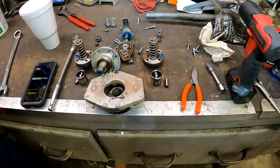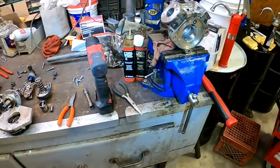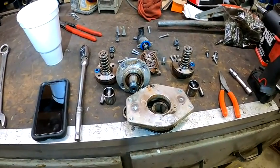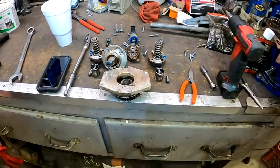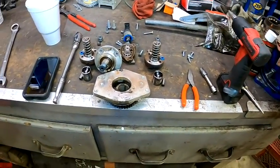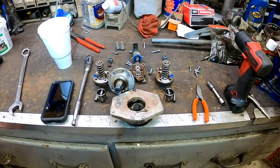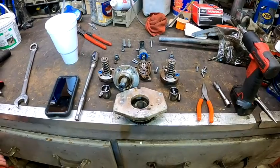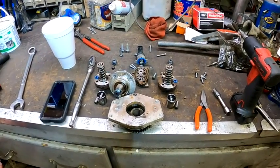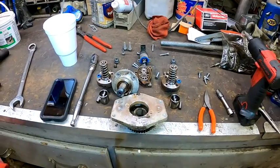So guys, that's what the internals of a CP4 injection pump look like all torn apart. There's the pump case, and of course the gear and the nut are down there. That's what it looks like when they're torn apart and that's why they fail — poor lubrication, lack of lubrication. These rollers just finally ate the cam and got enough metal through the fuel system that this truck quit running, was towed in, and had to replace the fuel pump pressure regulator, all the injectors, all the fuel rails, flush out all the fuel lines, scrub out the fuel tank. We did add a lift pump to help make sure there's always plenty of good clean fuel pushed up to the pump. Thanks for watching guys — please share this, drop down a comment, give it a like, subscribe to the channel, and we will see you on the next one.